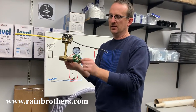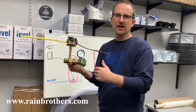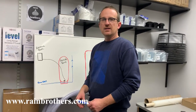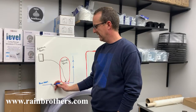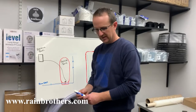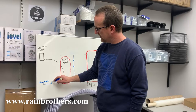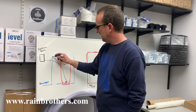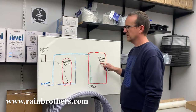It's a good idea to run a short length of garden hose on this boiler drain and run it to a floor drain to drain out the remaining water in the pressure tank. Once that water is fully drained, we are going to cut the well line before it gets into the pressure tank. From that point, wherever we cut it, we're going to run this water line into our well reservoir tank.